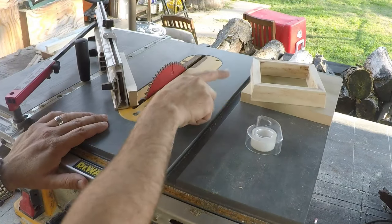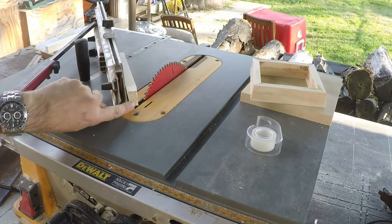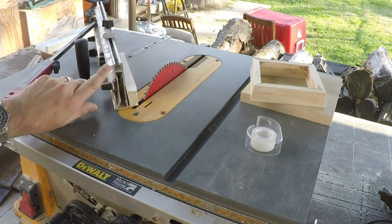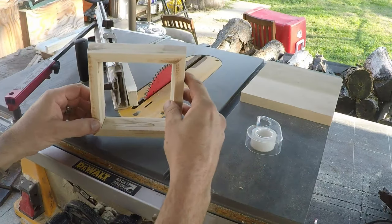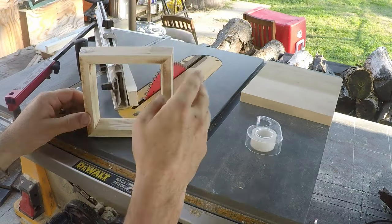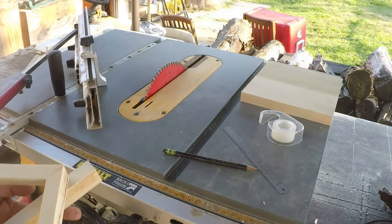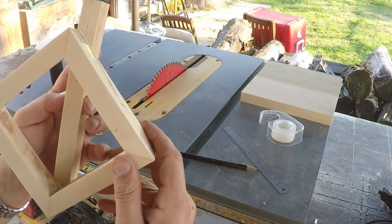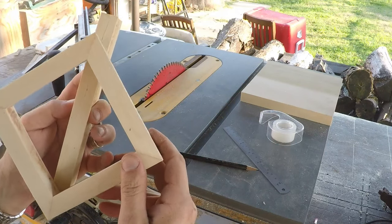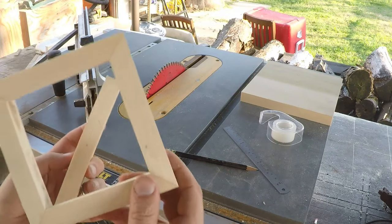We cut the angle on these at seven degrees. I've tipped my saw back over at seven degrees and put a center line right here — I just used a chisel so you probably can't see it. I'm going to try to cut to that and make a piece that will fit in here and lay in all these compound miters. That's slightly maddening to work out — it's very easy to accidentally cut your bevel the wrong direction. So I've got the original cut that I made there, and I needed to mark it out so I could find where to make my next cut. I laid this on here with the face that's going to match, then drew lines on the inside and put a center line so I can see the center.